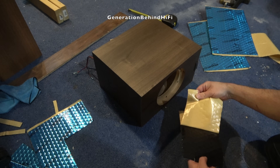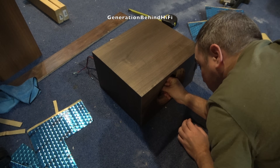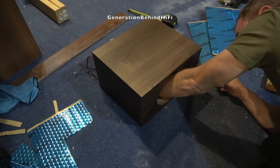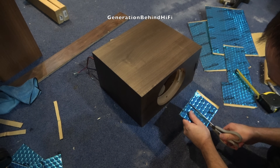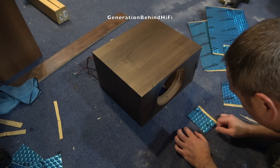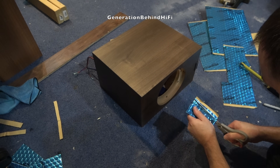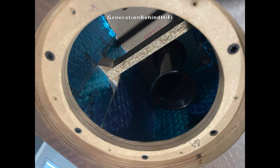Here I'm cutting the sound deadening material to size and fitting it to the inside of the cabinet. Even though the material has a peel-and-stick backing, I'm spraying 3M Super 77 on the back side to ensure good adhesion to the cabinet walls. Here is the finished cabinet after installing the sound deadening material — I only applied it to the top and two side cabinet walls. Even though this stuff is pretty thin, I want to be mindful of the internal volume I'm consuming, because if it shrinks too much it could have a negative effect on bass alignment.